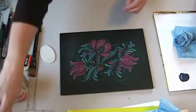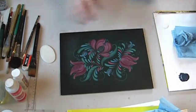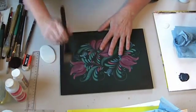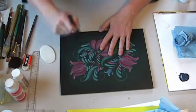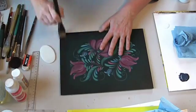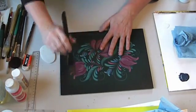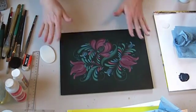Okay, so we would go into our varnish, not pouring it on our piece. Get our brush. We would apply another thin, fine coat, or you get your varnish sponge out, whichever method you like. Thin, fine coat of varnish. Do not put it next to the heater. And then you can wax your piece.